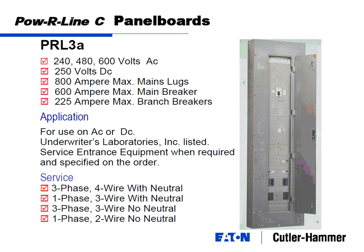And yet, you can also have these type of breakers, which in a power distribution panel, you can have 600 amps coming in, and maybe you want to take 3 sub panels out of there. So you can get yourself a 225 amp breaker, like this, to feed another panel board, which has another 42 of these. So now I've got the capability to mount both of these on the same chassis. Otherwise, normally you can see they probably wouldn't fit.